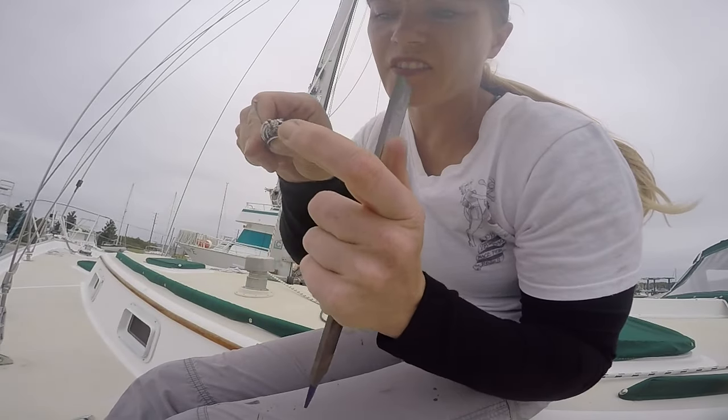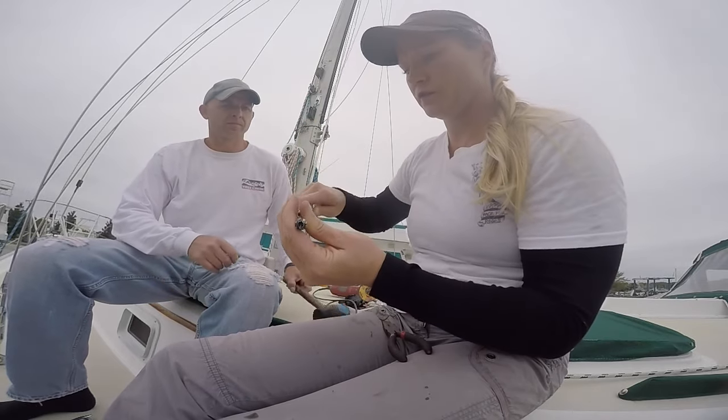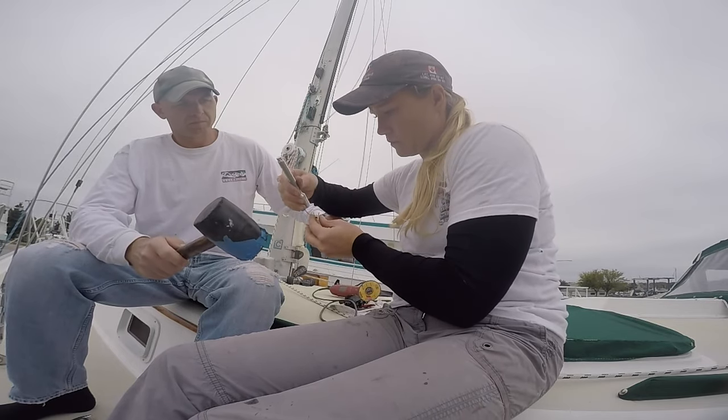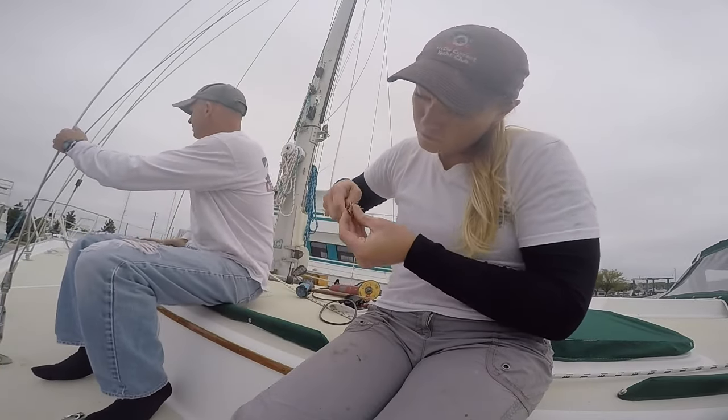The next step was to use a metal file to separate the cable strands to isolate the center core of strands. Philip would then help me hammer on the inner shell, which I called the bullet, as well as the ring that had slots for each individual strand, which began the tedious process of fitting the strands back into each slot.